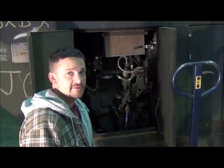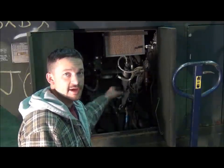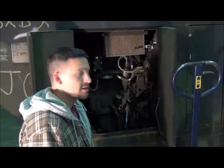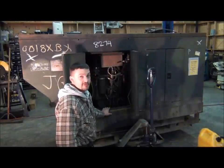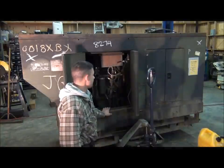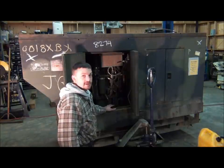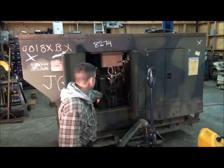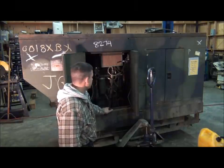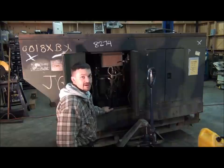We've got our oiling system all put back together and the filters installed. Now we'll move on to the fuel system — I'm going to install two new fuel filters and their housings, the water separator and strainer assembly. A quick overview of what we've accomplished: we repaired the power wire to the fuel pump, replaced the oil filter canister and its lines with a new oil filter, replaced the fuel filter canisters with new fuel filters, got a new radiator flex hose in, and filled it up with oil. We'll leave this panel open when we start the generator to check for any fuel or oil leaks.